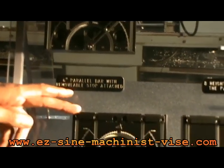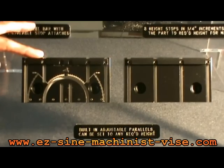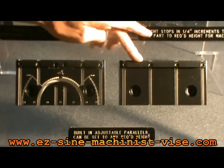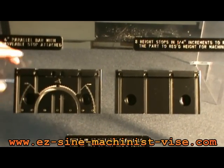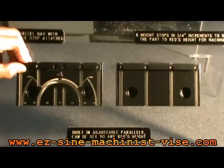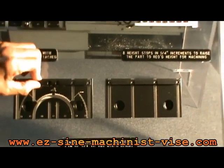The next component is the adjustable parallels — they'll hold a part as thin as 1/32nd or the full height of the jaw. You have one that goes on the angle jaw and one that goes on the moving clamping jaw. You can hold something thin, or use the whole height of the jaw for a larger part. The advantage over standard parallels is that when you blow out the chips, the parallels don't move on you. You don't have to take the parallels out, blow the chips off, and replace them. Everything stays in there nice and sturdy.